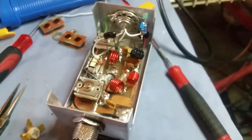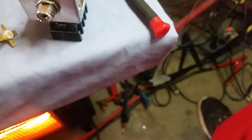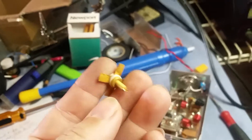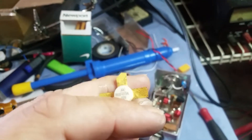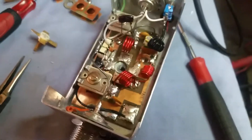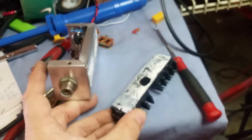We've at least got both of the L-matches done correctly. Even if the transistor was working I would have seen the L-matches weren't exactly where they needed to be, so at least we got them where they needed to be. I'm going to drop in a brand new old-stock 455A. I'm actually going to shorten those leads a little bit because getting that out was not easy. I don't completely agree with the way the heat sink is done on this thing.